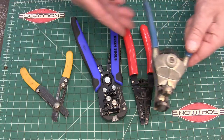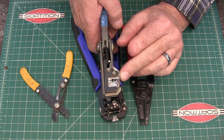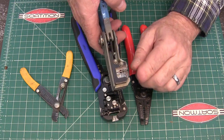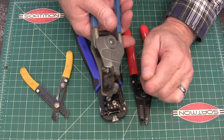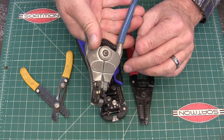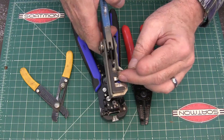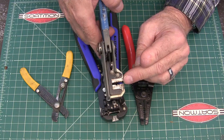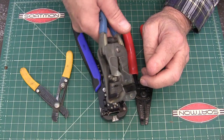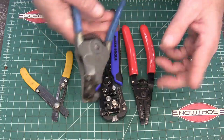Now I've had these for a long time and these are great, but the thing I've always struggled with is you have to know what size wire you're doing. A lot of times I'll put it in, I'll guess, and I stick it in here. You put it in there and it clamps down like that, and then you pull it and it pulls the insulation off. They work really well if you get the right size — because if you're doing stranded wire and you get it too small, it's going to cut some of your wires. And if you get it too big, all it does is kind of shave your insulation but it's still on there. So these are a little difficult.